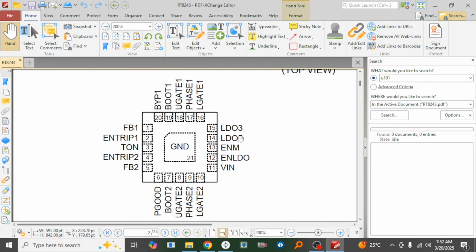All right, so I'll have to inject some voltage on this line to see if the APU is broken or the embedded controller is broken. But for the Intel platform, most of the time, it depends. The Intel platform normally has a shorted RTC section. I rarely find an AMD APU that has an RTC section that is shorted. Right, so most of the time for the Intel, sometimes it's the embedded controller and sometimes it's the PCH or the CPU. So I will check pin number 15.